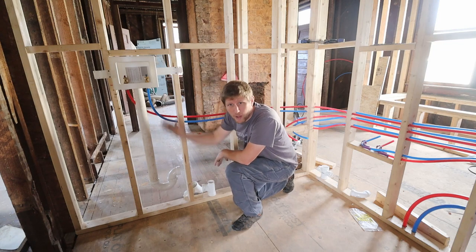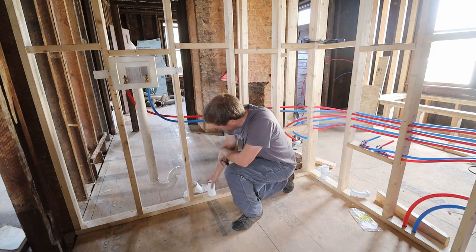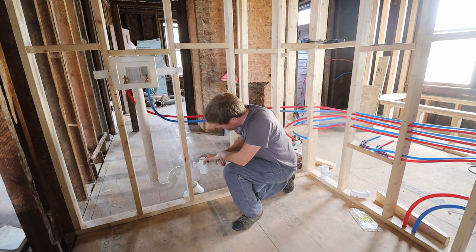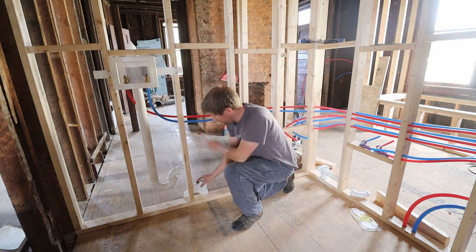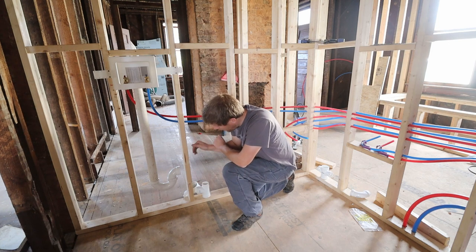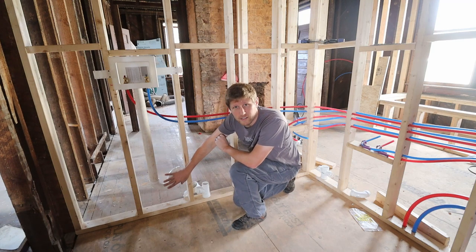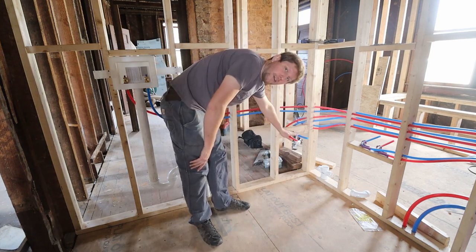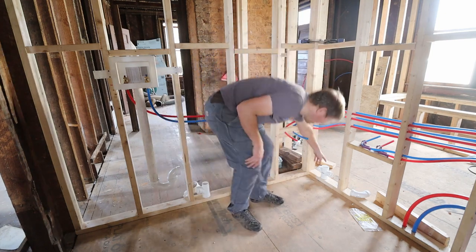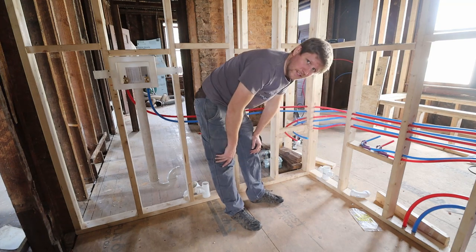And here's what's gonna happen. We have a standpipe, and you can see obviously there's a P-trap on the bottom. There will be some kind of sanitary tee that then also lets me vent up to the ceiling. And then I will connect it down into the floor. And then in the floor is where I'm gonna connect this drain with the laundry drain that is coming right here. And then also the double laundry drain that I need for this side of the bath.